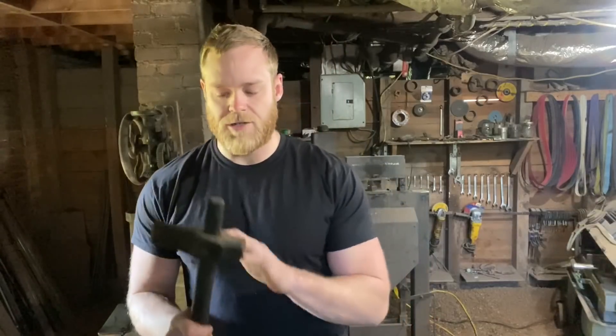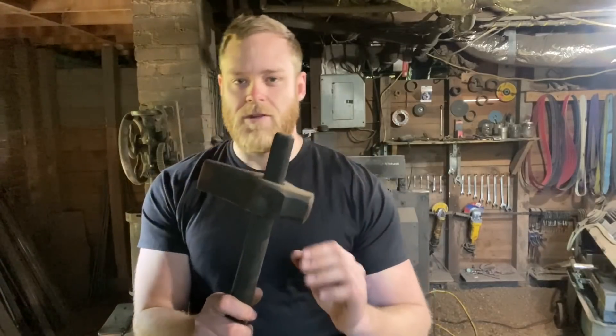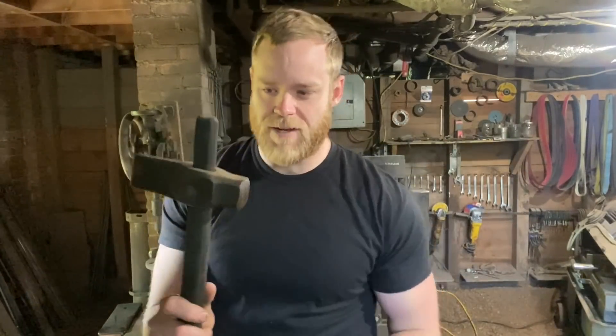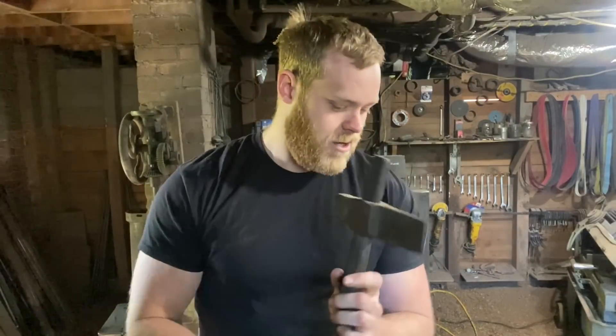First on the list are the H13 handled hot cuts. These are a great tool. This is my personal one. I am going to do them a little bit differently. As you can see, this has all been ground clean, and it's got that nice brushed finish, but it really doesn't go with the style of the rest of my tools. So I'm going to try a different method where I forge the cheeks and the struck end closer to finish, and the only significant grinding is done on the working end, similar to how I do my hammer eye punches.